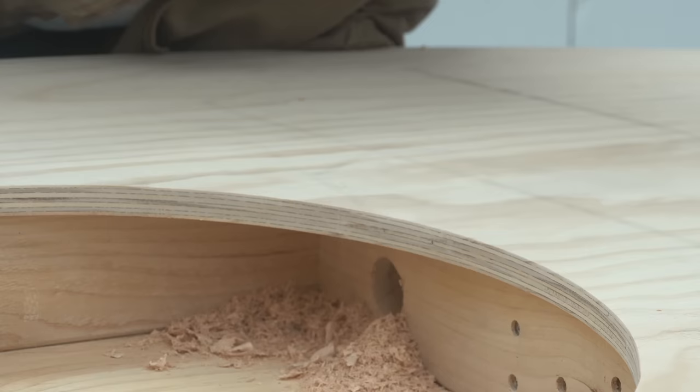Now we're on to legs and I'm going to be using the semi-exact spider legs designed by Chris Salomon. I'm going to alter these a bit — not recommended — but to get the leg where I want it, I need to cut away a few inches from the mounting plate. I still think there will be plenty of strength, which is why I'm doing it. I used a metal cutting disc on my angle grinder after scribing the line. I added a three-quarter inch piece of plywood to get my tabletop closer to 30 inches, which is standard tabletop height, then screwed down my spider legs, alterations and all.